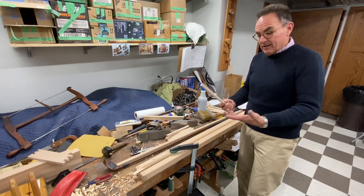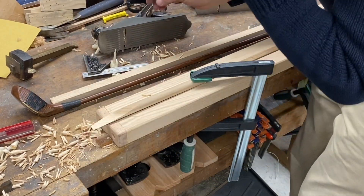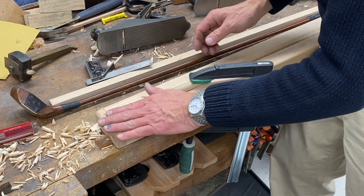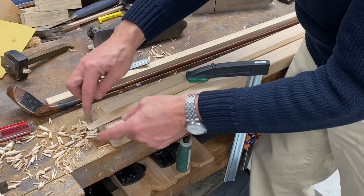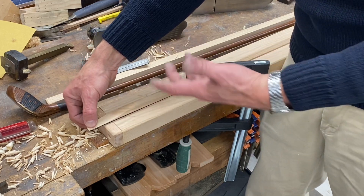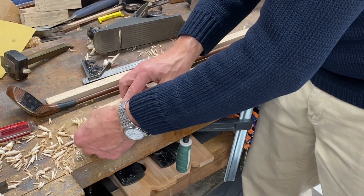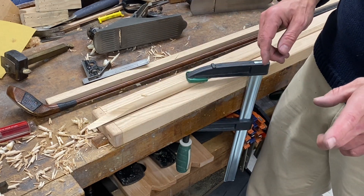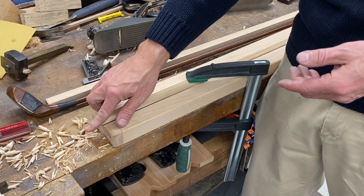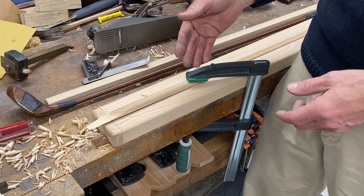The dowel rods are three-quarters of an inch diameter hickory, which should fit most shafts. Brad notices a little more flex than he'd like as the piece gets thinner, but explains this is normal — there's less material to resist the load so it flexes, just like golf shafts flex when you swing them. His preference if anything is to have a very slight concavity rather than convexity, so that when glued with hide glue a small clamp can close any gap.